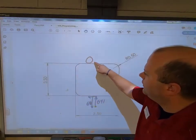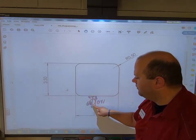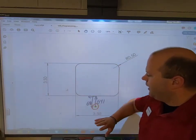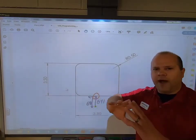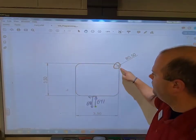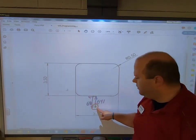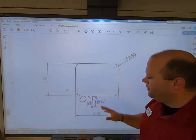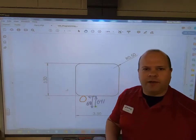The tool will go all the way around, come a little bit past the starting point so the tool cleans up where it entered the material, then come down for G40. Without cutter comp, if you program from centerline, the tool violates the profile. By turning on G41 and telling the machine the diameter, when it moves to the part it places the side of the tool exactly at the side of the material.